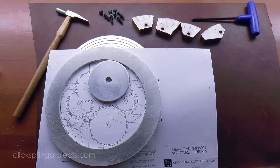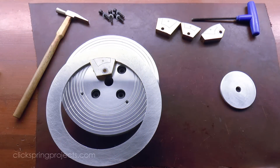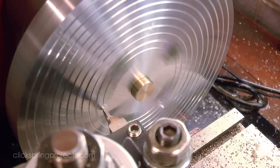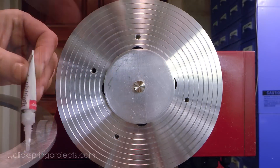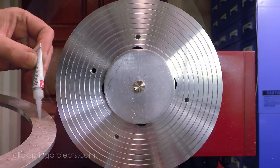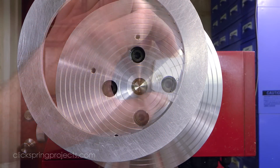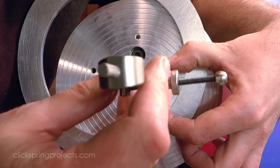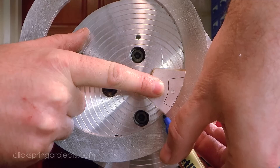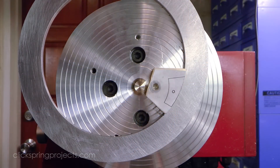The geometry associated with each support can be recreated on the face of the arbor, using first the correct alignment disc to position the annulus, and then using the inside diameter of the annulus to register the part. It's fairly straightforward to align the part by eye for this second cut, bearing in mind that the arc will be more accurately marked out with dividers later. One way to ensure that the part falls within the boundary of the raw stock is to simply leave an excess of margin material at the sides. A small alignment error then becomes of no consequence, causing nothing more troubling than a shift of the part a little to one side.